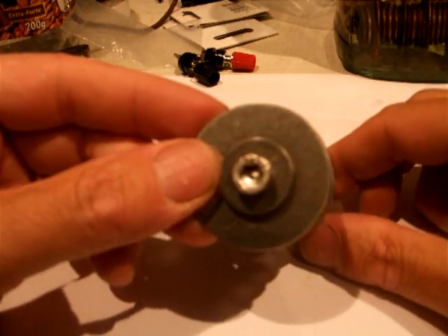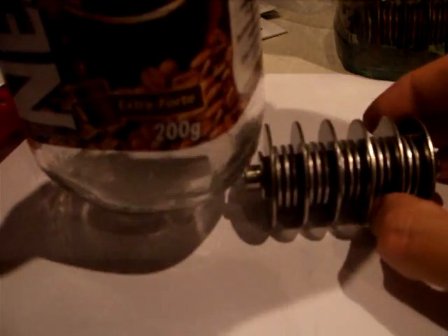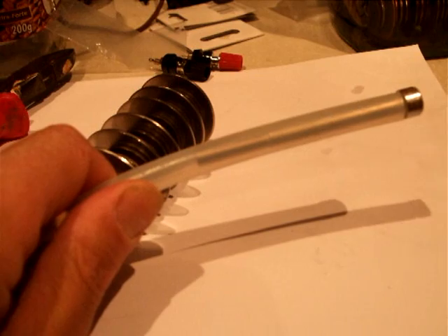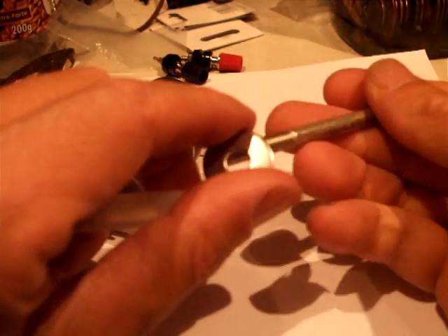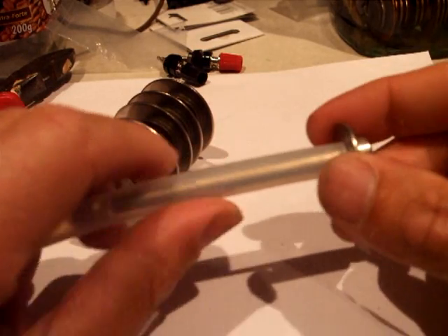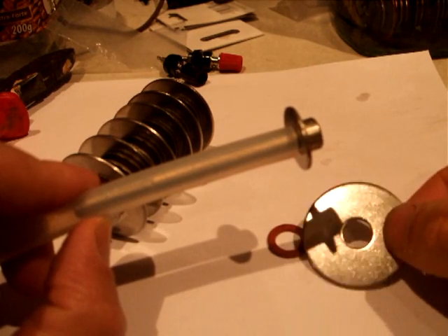In this section I'll be talking about how to make the cell. This cell has 6 large washers, which is slightly bigger than the other cell because I'm going to get this one going in this other smaller coffee jar. It has a good solid lid for drilling and the cell will fit diagonally in the bottom, which is ideal. Here we've got the bolt going into protective pipe sleeving to stop any of the washers from making contact. You can easily cut this to size using a Stanley knife. On the end of the bolts it does have to have a washer because the size of the head is too small for the other washers. The other washers kind of slip over it. So you have to pop this on at one end and then the pipe, and then the other fibre washers, and then you place the other washers over them.